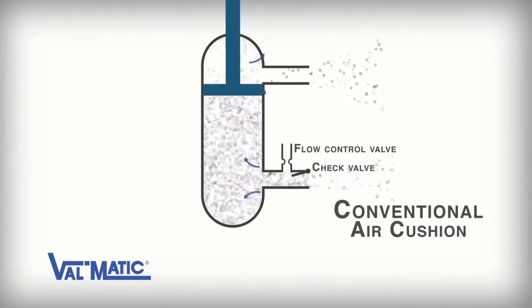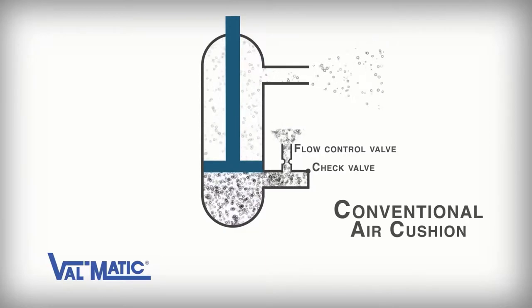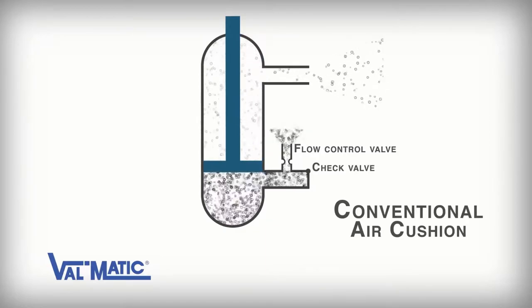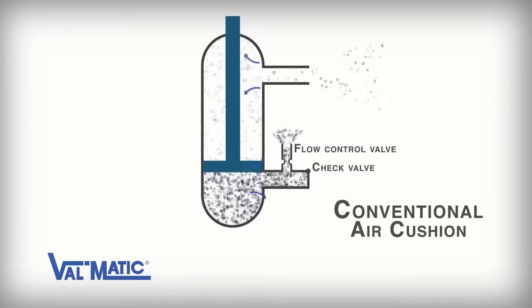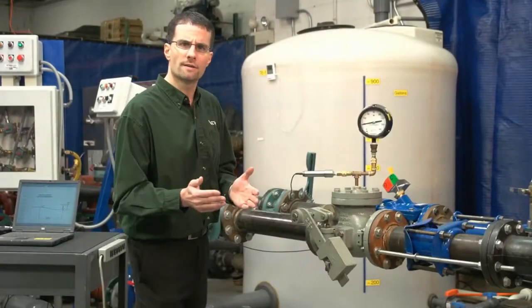As the door opens, air is drawn into the air cylinder. Then when the door closes due to the force of a spring, the compressed air cushions the closure of the door so that it does not slam.